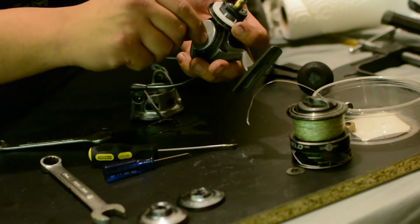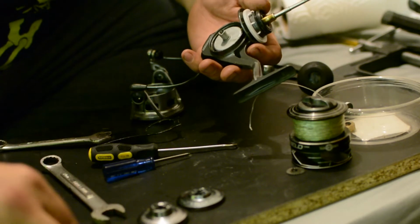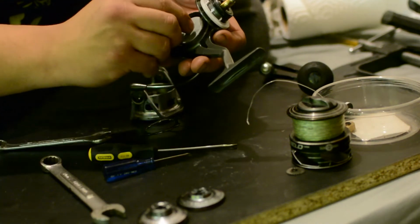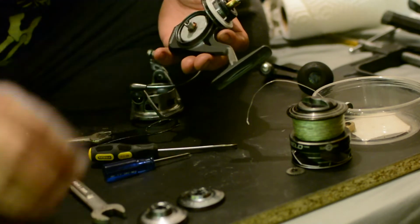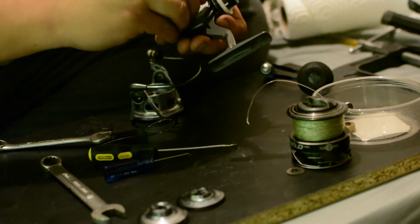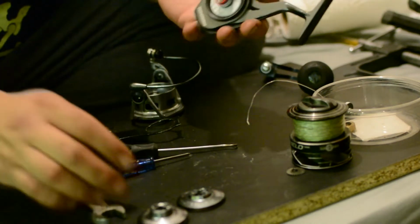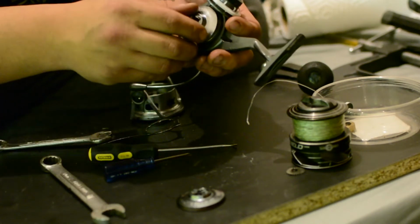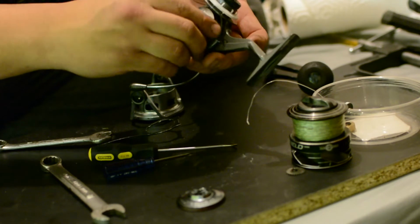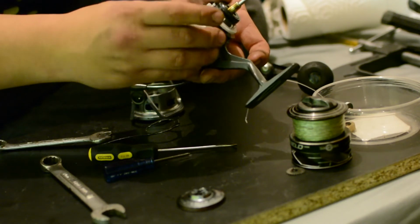The main gear goes back on there, and then you take your 3 little washers, slip it back on that shaft, your bearing and your seal, and that's that. You take the cover at this point, and you're gonna go counterclockwise to tighten.